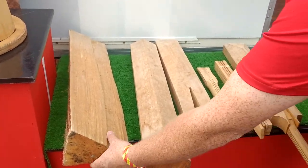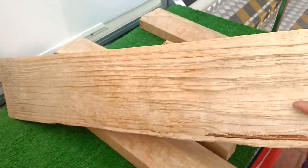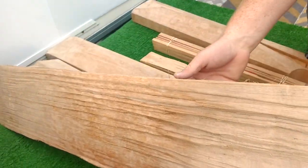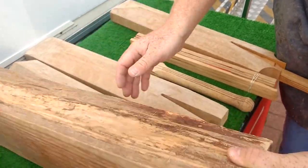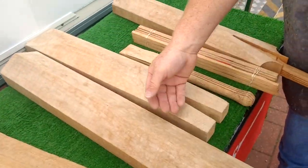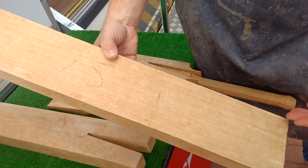This is where we can start to see the quality of the timber — the way the grain's running, whether it's nice and straight or whether it's bendy, or whether you've got knots and faults in it. From this we'll cut one cleft. One of these surfaces — the best one — will be your striking surface. Two edges and a back. So that's your cleft — that's what we're going to make the bat from.